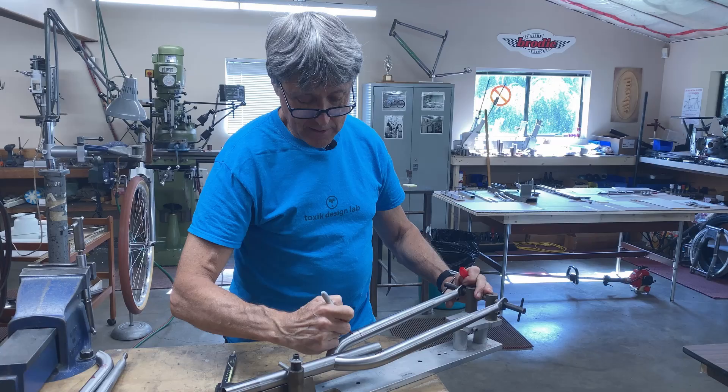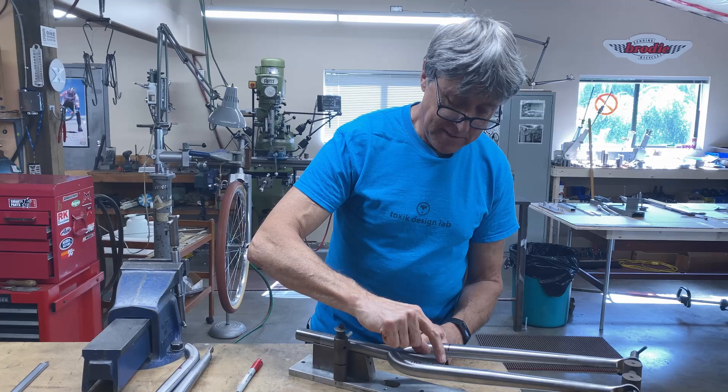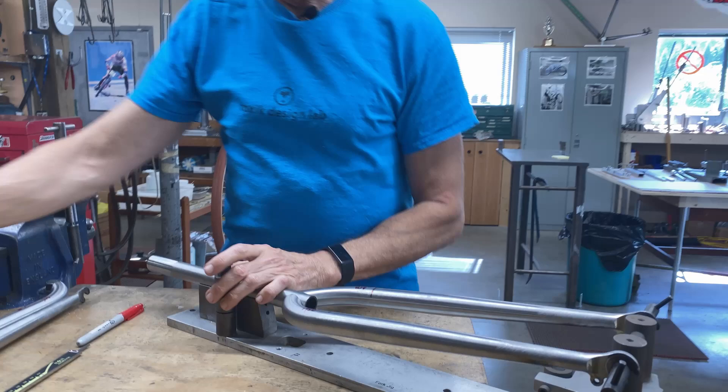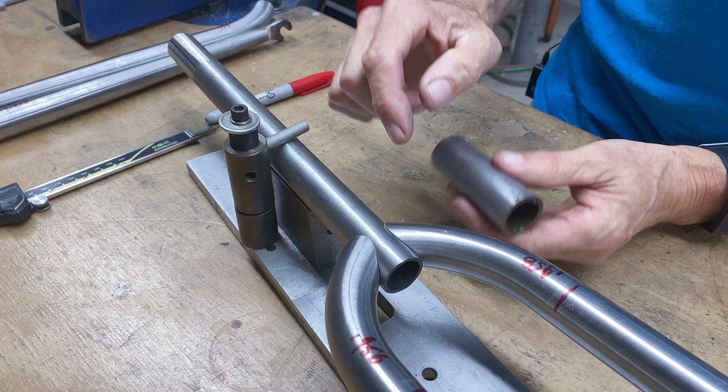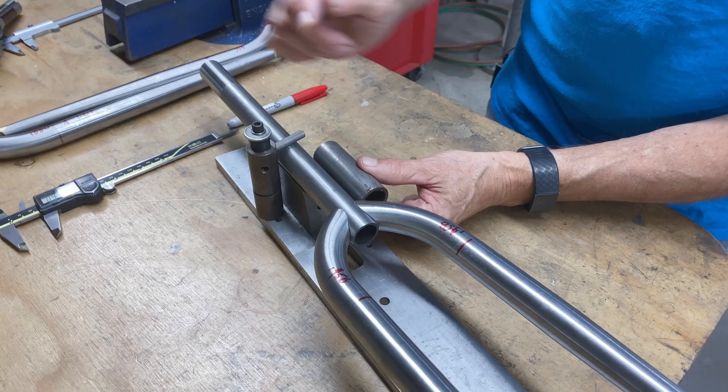What has to happen now is that we have to miter this just a little bit, because there's going to be a radius on the brazing as it comes around. Then we're going to take this piece of tubing here and make a little bit of a crown race, so that when the brazing is done this goes back in the lathe, the chuck spins, and the crown race is machined. I'm going to show you a quick photo on my phone.